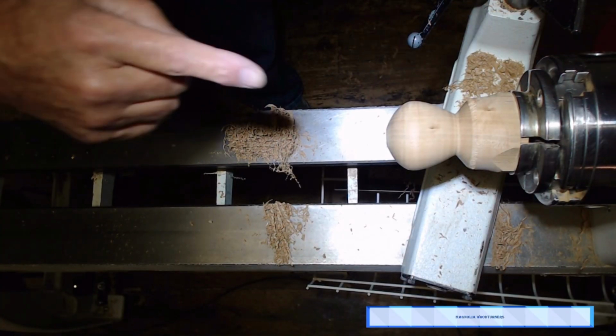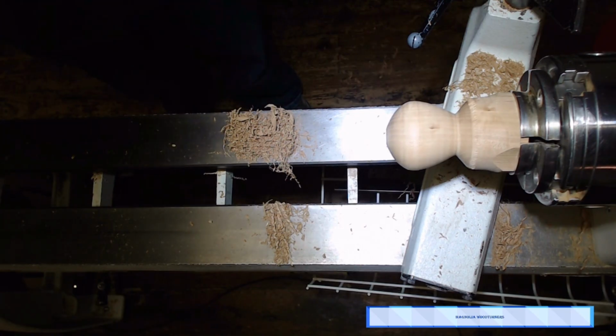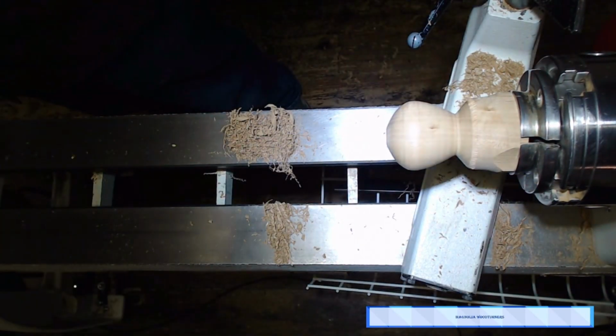So 1 is what I just did. That's drilling your hole to the center. Then I'm going to take number 2 here, which is I'm going to take the straight tool and widen that hole out to the bottom. And then with a straight tool again, I'll do 3, try to get it down some more, and then out 4 down to here. Then I'll get the hook tool to do in here, and then 6 is the finish. So I can pass it around, you guys want to take a picture of it, or you can download it. You want me to pass it, or? No? Yeah, whatever.